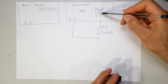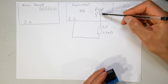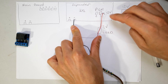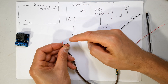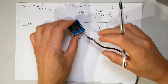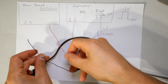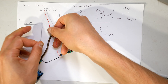You're going to need to connect your positive wire from your programmable output - say programmable output one - to the positive of your relay board. The red wire goes there and your black wire sits on the negative of your expander board. When you arm your alarm this goes positive, so on the other side of the wire you'll have positive and negative, connected directly to your relay board. If you chose to use your main board, whichever programmable output will be your positive and the negative will go to the auxiliary terminal.